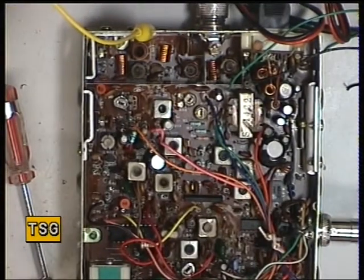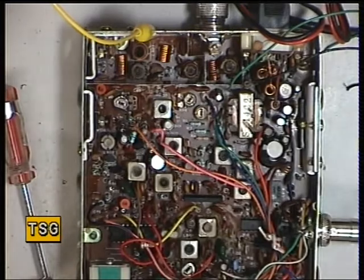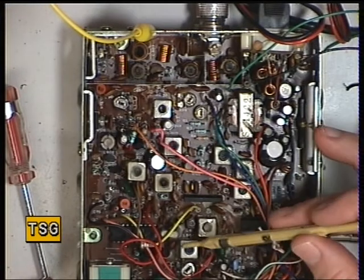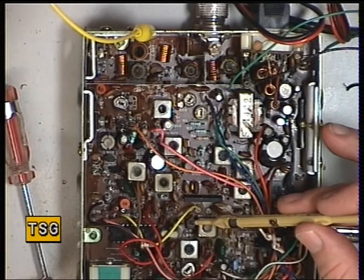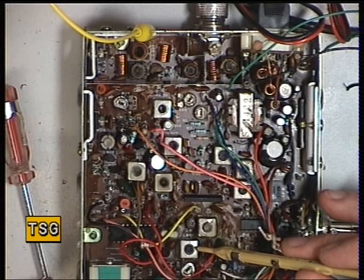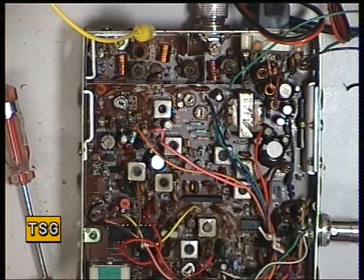Welcome to the receive side of the Harry Moss PT325. We've got the signal generator on with a 3 microvolt signal it's receiving. Because the receive is set up to a different frequency arrangement to the transmit, we set the 10.24 with the trimmer for transmit, but for receive we're just using this coil here, which I think is L506.